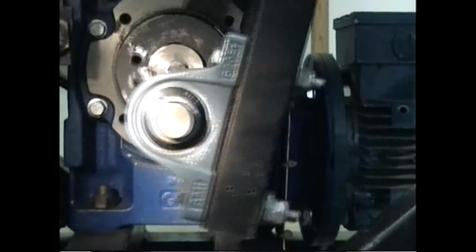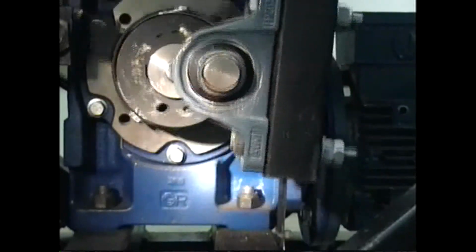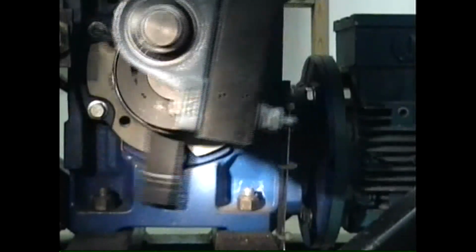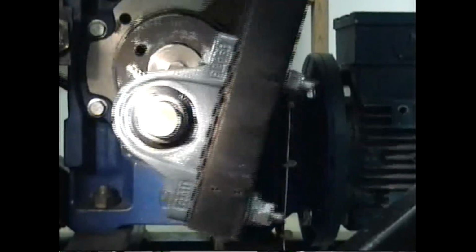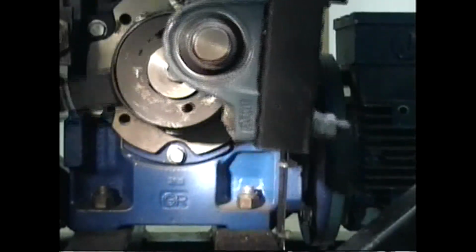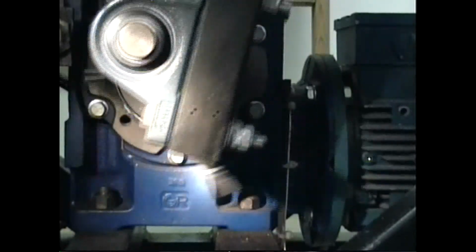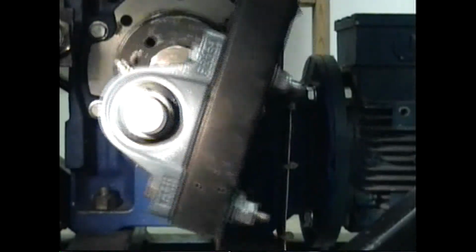They had ordered a new gearbox thinking it was something in the gearbox. It was not the gearbox, it was the shaft between the drive motor and the gearbox. When this thing kicks into the higher ranges and it rocks back and forth on that motor, the key was wobbled, worn real badly, the key on the shaft out of the motor into the gearbox. We took it apart there and found that, and when we put a new key in, I enlarged that key slightly just by pressing it, and it fit in the slot, and that prevented that noise between the drive motor and the gearbox.